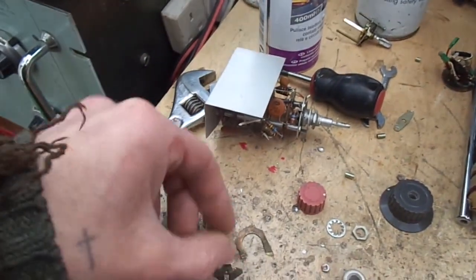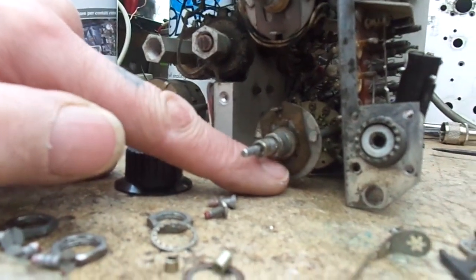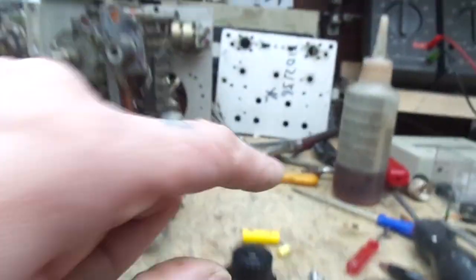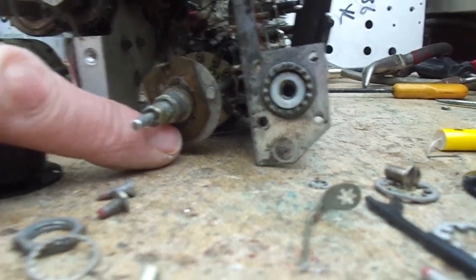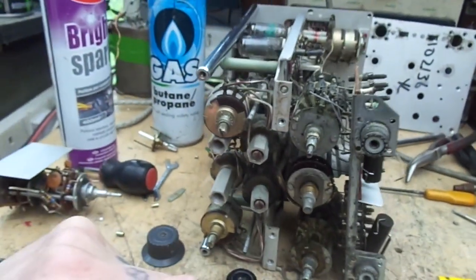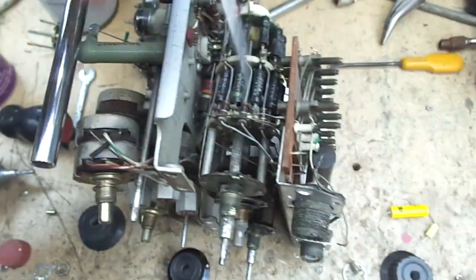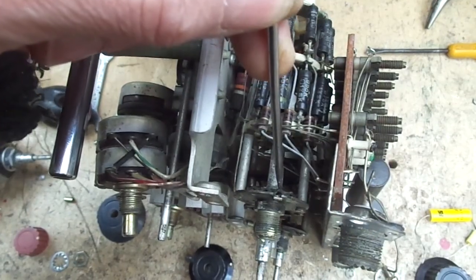And what it was is this little spring that keeps that. You can see on this one, I've got this sort of brass spring, and when this is mounted with this base plate on, that'll push against that, and the springiness of the brass material will put a bit of pressure on that, the ball bearing. And if you look in there, got this sort of ribbed washer affair, and the ball bearing clicks into those.